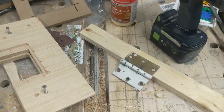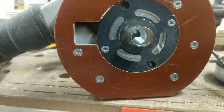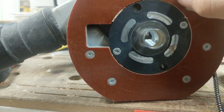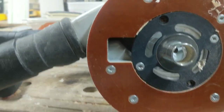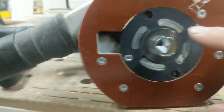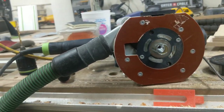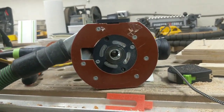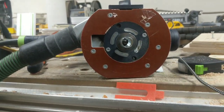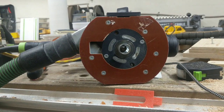One of the biggest secrets to this, and one that more and more people should be made aware of, is this bushing right here. Router template bushings make the router one of the most versatile tools in construction or woodworking in terms of making anything you need to make and being very accurate and precise in doing so.